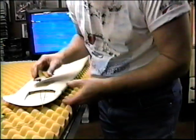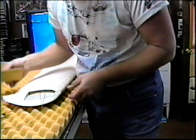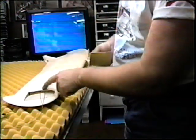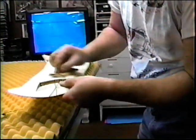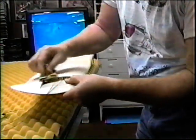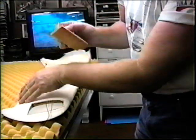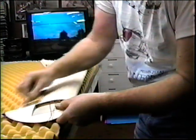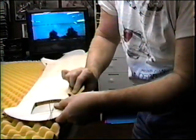The next step, now that the epoxy is dry, is to get all of these edges, and I'm just thinking of something here because I already broke it with my finger taking the tape off. I'll put a little plywood piece on the edge here, 64th plywood, but getting all these edges sanded out, and this again is time consuming because we've made everything about 1/64 of an inch bigger than it has to be because we had the tape on there. So now getting the blend. And we'll spend a little time on this because I want this to really be right.